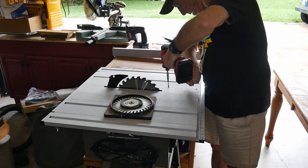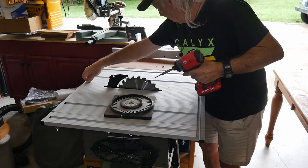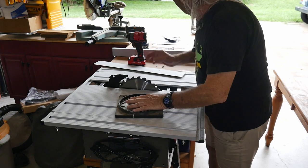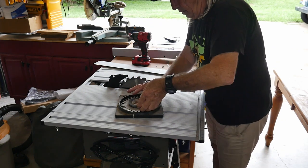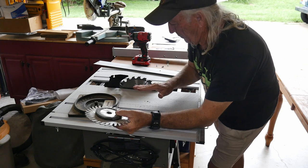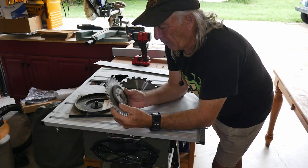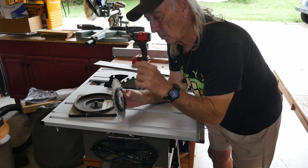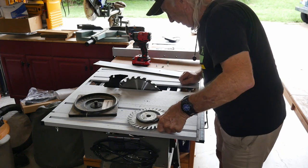This is actually kind of illegal in certain countries — go to jail or something, I don't know. We'll find out! The adjustable dado — that's why I like it so much. The problem with a dado of this type is the saw has a bit of a brake on it, so after you hit the stop switch it jerks and stops, which could throw the setting off. What this type of dado does is as you dial it in, the blade wobbles more and more to create wider and wider cutouts. It's a little strange, but it does work.